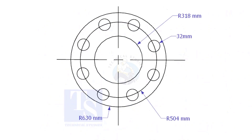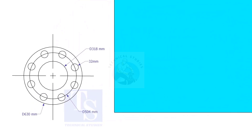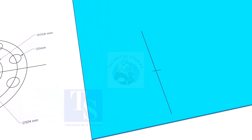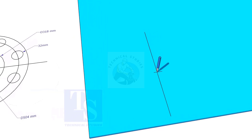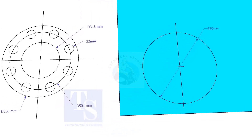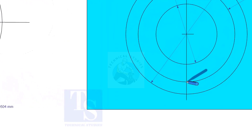Let us mark this flange. Draw a line 10 millimeters more than the half OD of the flange from the edge of the plate. Cut this line marking half OD plus 10 millimeters. Punch mark this center. Then draw the OD and the ID circles. Draw the PCD, and punch mark where the PCD circle cuts the center line.